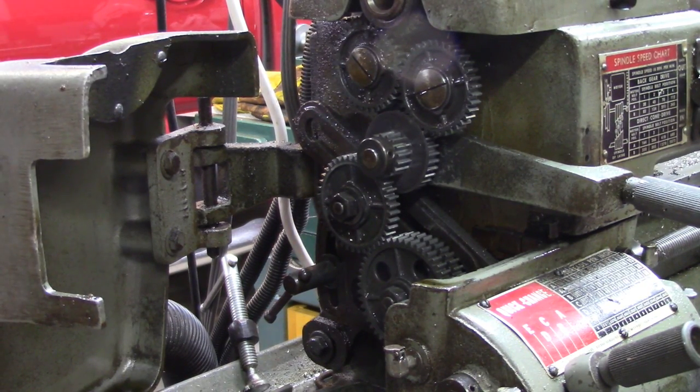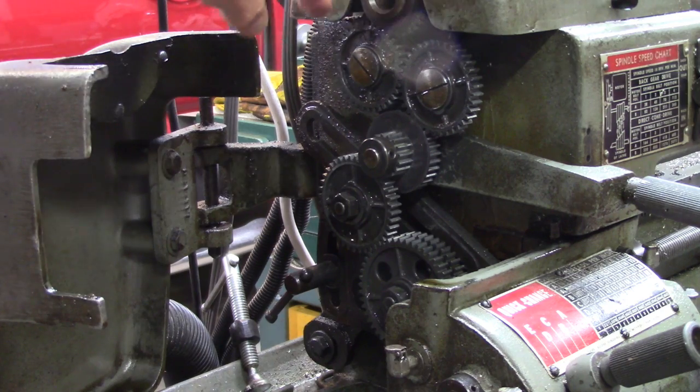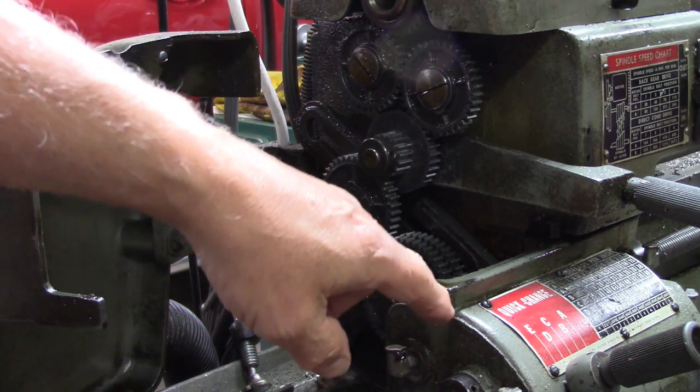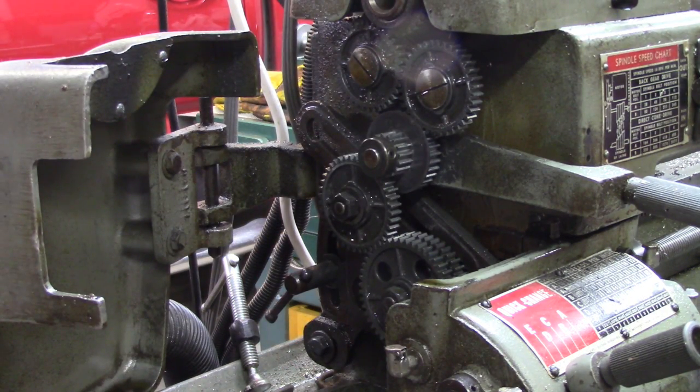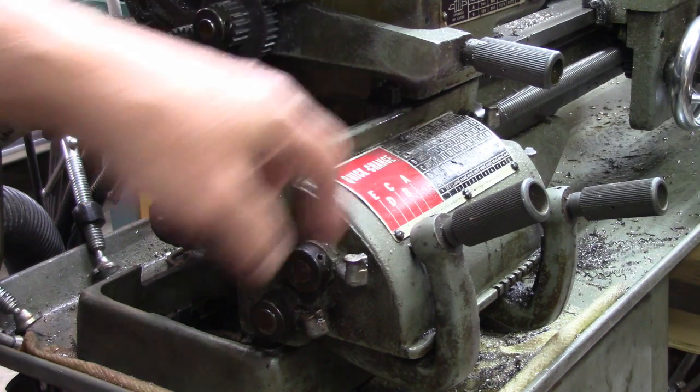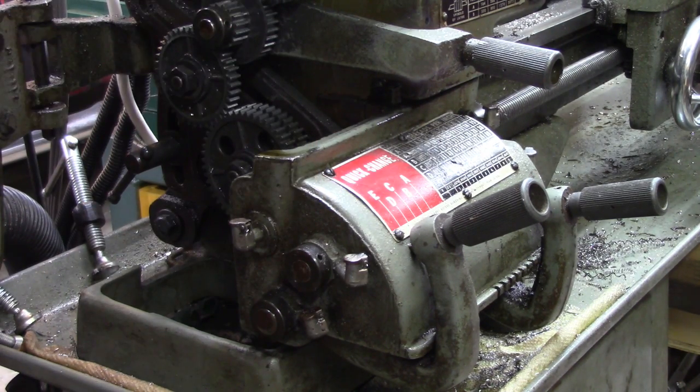Have you ever considered an electronic lead screw? Let's look at the situation here. We see all those gears connecting the shaft that's got the chuck on it, down through this little gear train, down through the gearbox and connecting to the lead screw. It's all locked together and working in step. Using the quick change gearbox you can set it to make all kinds of different threads, and using the gears I made a while back, I can have it make metric threads by setting various settings on the quick change gearbox.